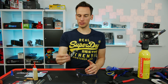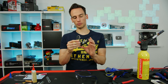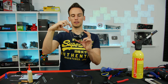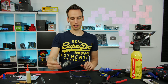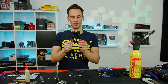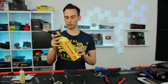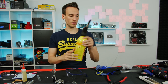The conclusion is that we will still stick with the DIY glass cutter. From my experience it still worked the best among all the options tested. It's still not perfect but we're getting there. I might update the arm to make it a little bit longer so I can apply more force or have better control. Also maybe improve the tolerances on the wheel since it's still moving a little bit, but this is still the best option we have for cutting. For working on the edges, the torch is by far the best option - an extremely nice idea. Thank you very much for the feedback on the torch idea. Just one minute applied on the tube and it looks perfect afterwards, extremely smooth, and just slides into the fitting.